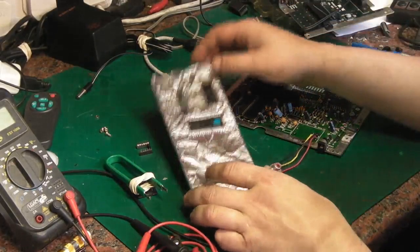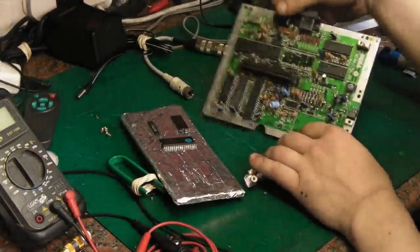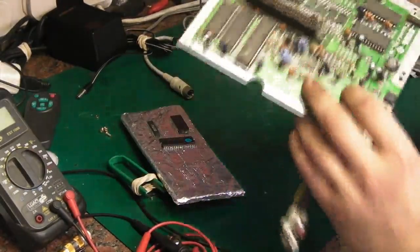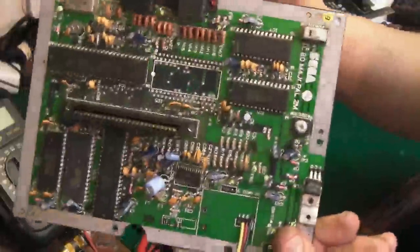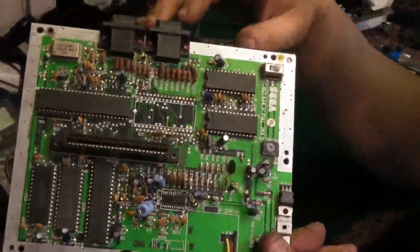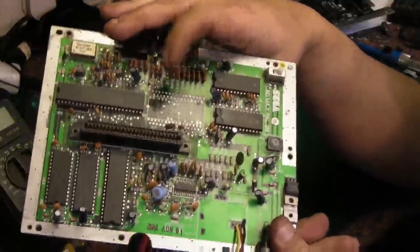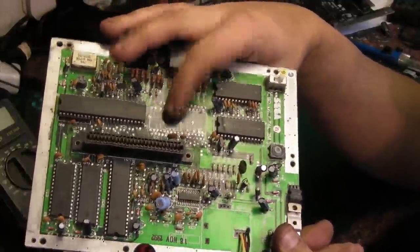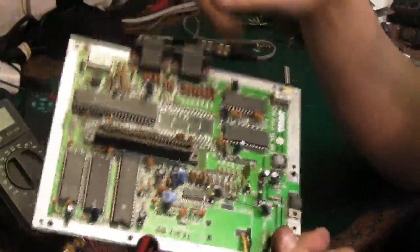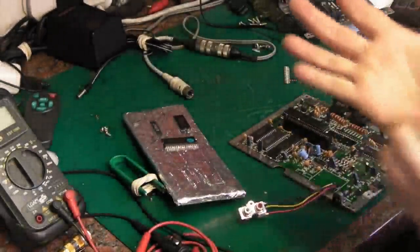Okay, we're back, and as you can see, I've removed the VDP from the donor board. If you look here, you'll see where it's come off. Have a look on that side. No damage to the donor board, so if we do want to reuse this for something, if it doesn't indeed prove to be the problem, I may stick the VDP I'm going to take off the Mark 1 board on here, and then try and find out what else is wrong, because it does basically work, it just has that one glitch on it, so it'd be okay as a test chip.